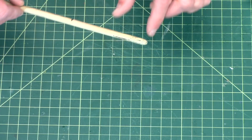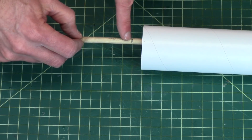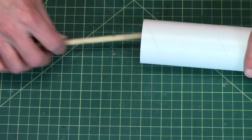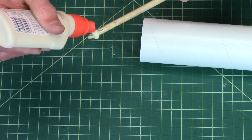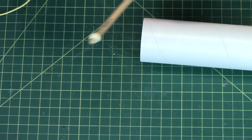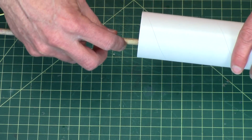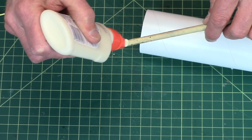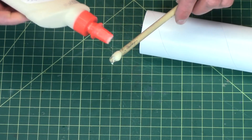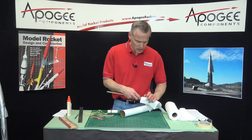I'm going to put glue right here and shove it in the tube, then smear it around — and you'll see that I keep the mark outside of the tube. That way I know that the glue line is in the right spot. Now here's the trick: you've got to keep this rotating, because if you don't it's just going to ooze down and drop on your table. Keep it rotating, put it in there, and start smearing it around. I'm going to do it a second time to get some glue in there. Keep it rotating. Good — there's no glue on the dowel.